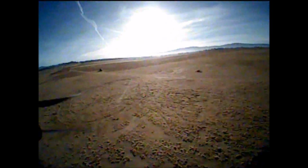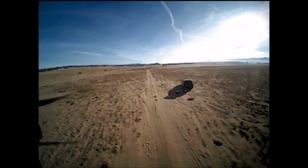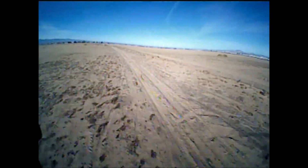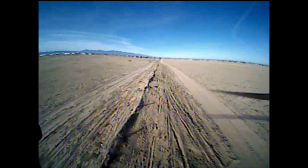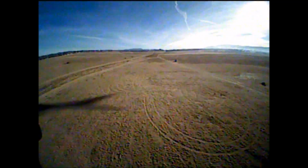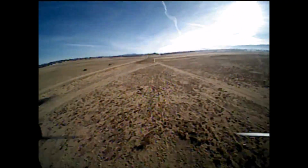So it's really nice. Now, some of the other VTXs nowadays come with 140, even 170 degrees field of view, which is excellent. This one weighs in at 4.8 grams, guys. So you are able to put this VTX on toy quadcopters using the toy quadcopter's battery power as well. If you configure a Y connector to siphon off the battery power of a toy quadcopter, or do like what I did here, was piggyback another tiny little 3.7 volt 200 or 260 milliamp size battery on top of the quadcopter and run the power so that you're not using the power from the quadcopter, as well as negating some of the static that the quadcopter gives off if you siphon the battery power off of the quadcopter.